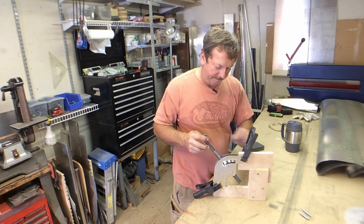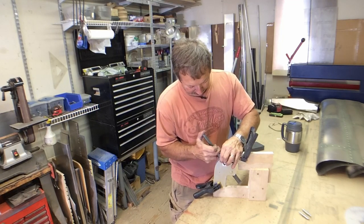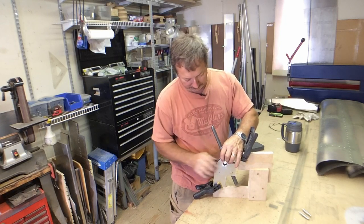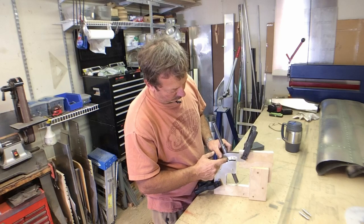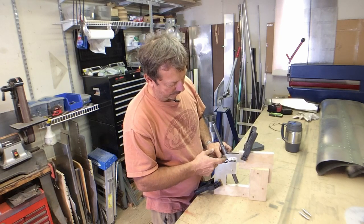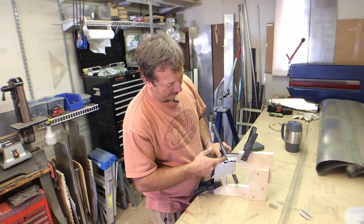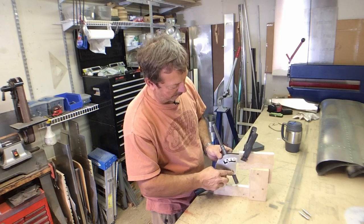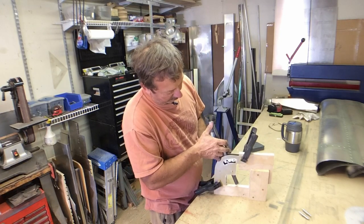Good. There we go, standoffs, it'll be in proper position. And snap in. I'll have to be careful, and we only want our roll pin to come up as far, or not quite, so it matches right at the top of our radius for our detent, because otherwise we'll wear the aluminum excessively. And yeah, otherwise I think that looks good.